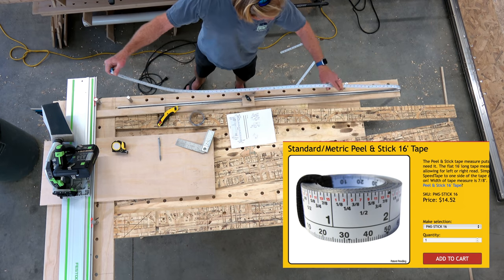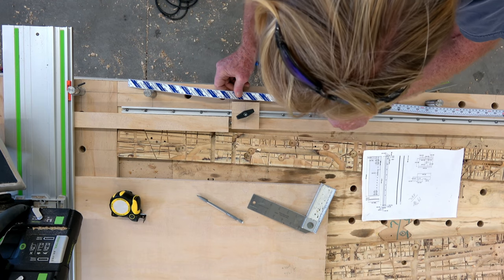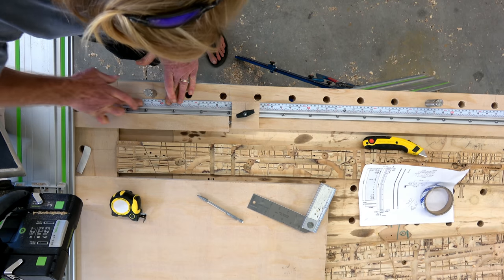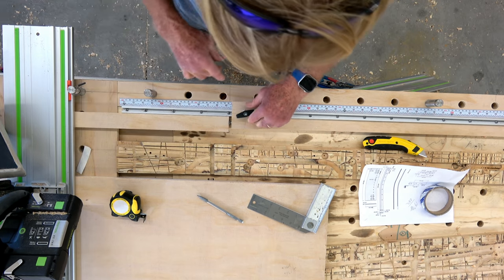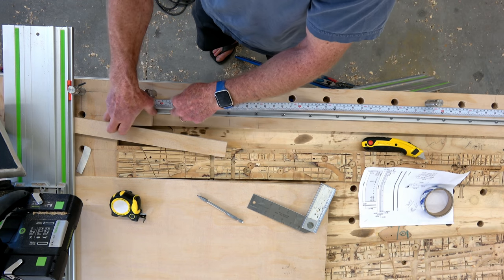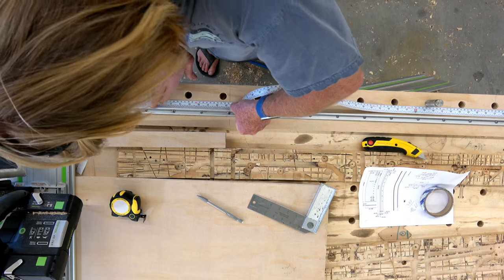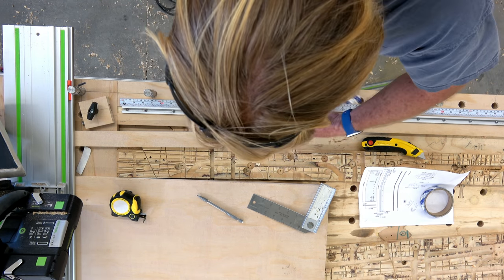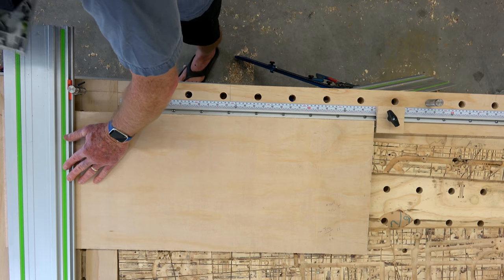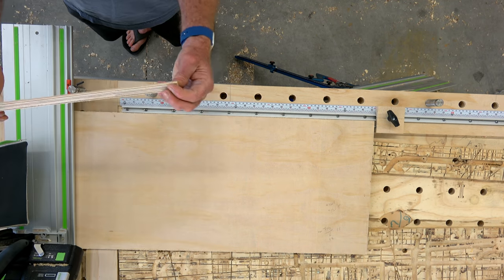I'm using my very favorite peel-and-stick tape from FastCap — the metric and standard version. I'm doing more and more of my cutting with metric; I find it a lot easier and very accurate — none of this 'it's half a sixteenth' business. I peel back the tape, get it started, stick it on just a little bit, and double check my cut. I cut a piece to an exact length, set my stop up for that, then put the tape to that. Once it's stuck on, I peel off the rest of the tape. I still have that micro adjustment if I'm off just a little bit. I also cut a little shallow dado behind the T-track to keep the tape placed safely.